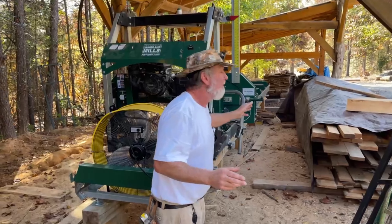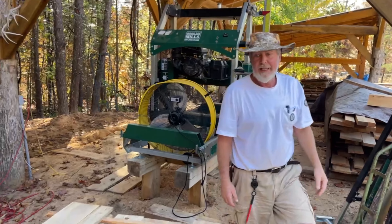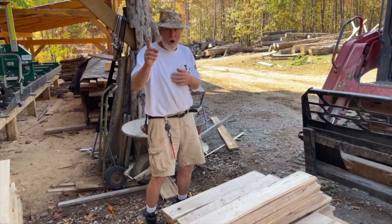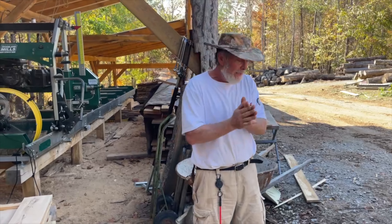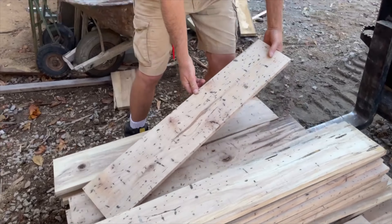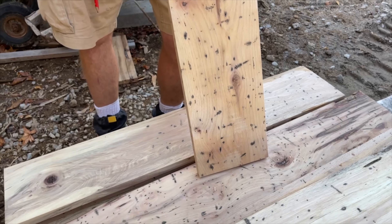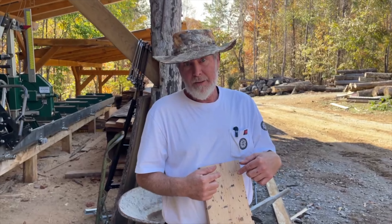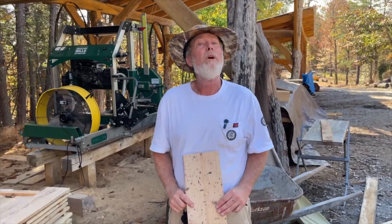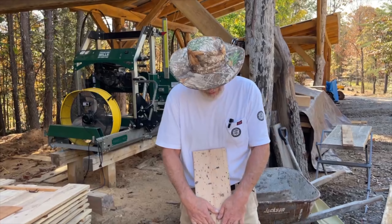Jay and I have stacks of wood processing all over the place, stacks in the kiln getting ready. We showed you delivering this to the kiln. We picked this particular wood because all the trees were cut on the lot of the carriage house when we did the main pad. These logs have been around for a couple of years and they actually got post beetle. We went through several processes - when the wood came out of our kiln it was dry enough, but I decided to bring it to a vacuum kiln and cook it for four days at 160 degrees to verify that absolutely no bugs exist. I probably didn't need to, but now I know for sure.